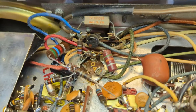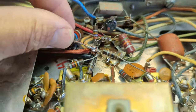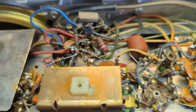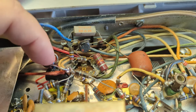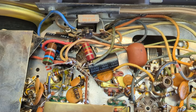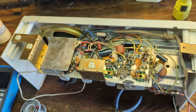Man, this is a messy radio. That's the first cap replaced — I chopped the old one out, now all the new stuff goes here. It's not going to go anywhere. I know it looks messy but so does the original. One down, two to go. It's point-to-point wiring — it never looks good. But now that we've got those replaced it should probably remove the hum.